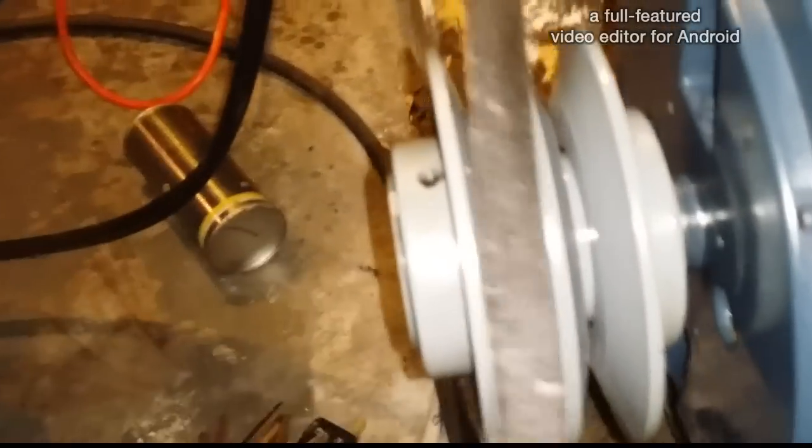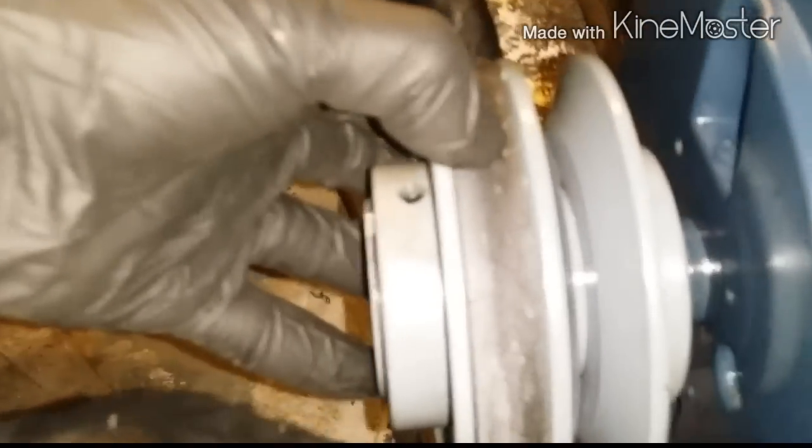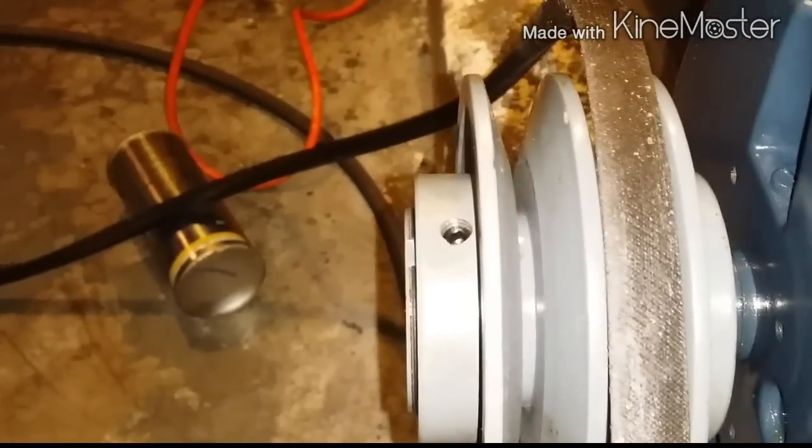In the groove. Yeah, so you put it there. That's pretty much good there. But we have to take an amperage reading to determine it. We might have to open it one more, or another two or half. We go little by little. It's a little tight in there. But we don't know, the only way to determine that is by starting it. We'll just keep it like that for now, and that's it.